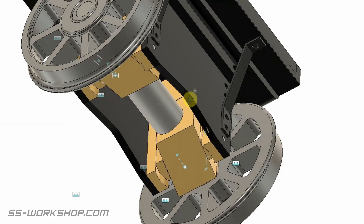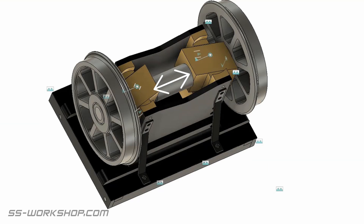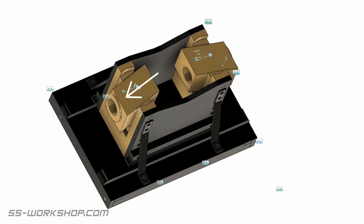Now let's take a look at how it works. The radial axle assembly allows the axle to move sideways and rotate slightly as the locomotive goes around corners. In this design the axle boxes can actually slide and there's a cylindrical bearing arrangement to allow that motion to happen. This design is quite unique to Avonside built engines.